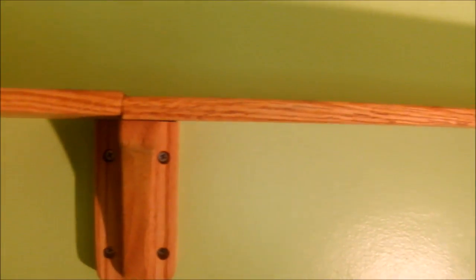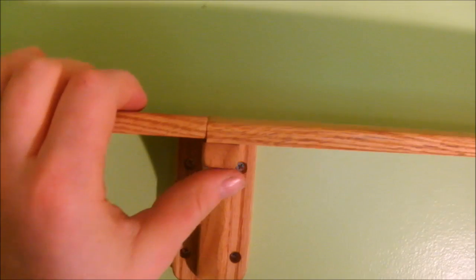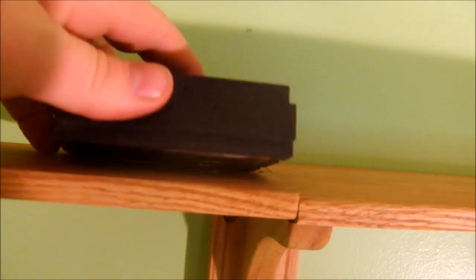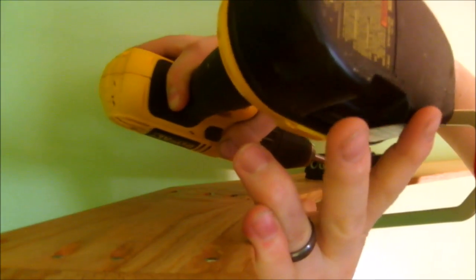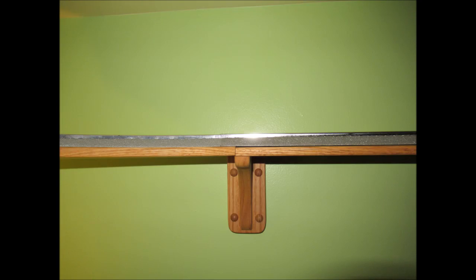First wall is up — three to go. I have a little bit of an issue with this joint here. You can see where the corner meets this board; it's not centered on my bracket, so I can't get a screw to come down into the bracket. I just got a couple screws in the back, so the front is lifted away and I want to make this flush. I'm going to use my pocket hole jig, set it right here, and angle a screw into this board. That pulls that joint together nicely.